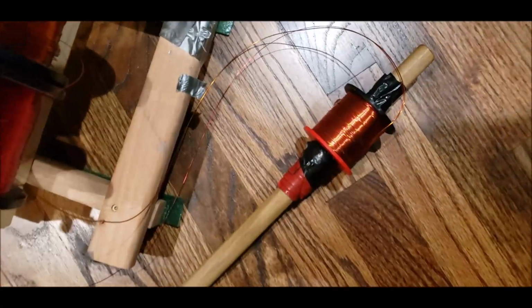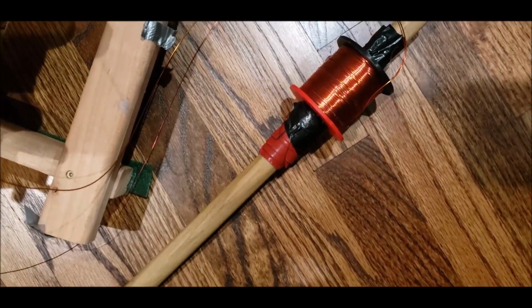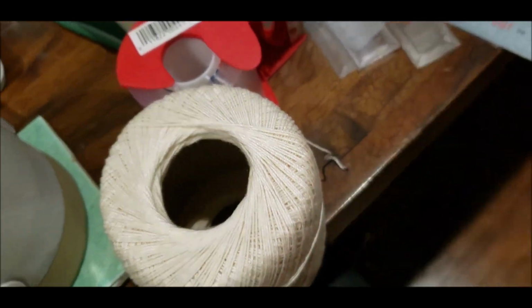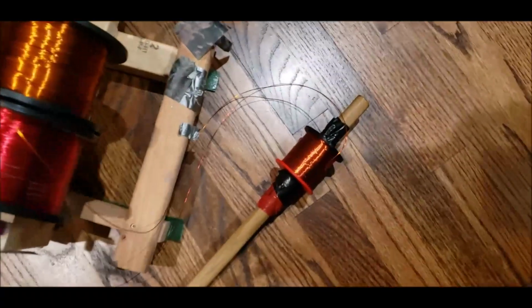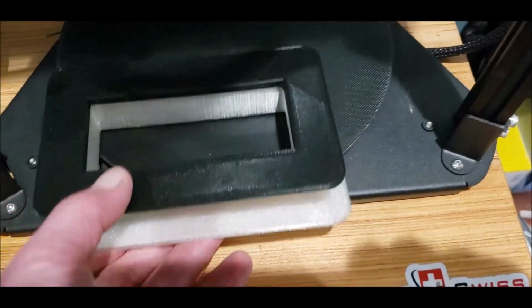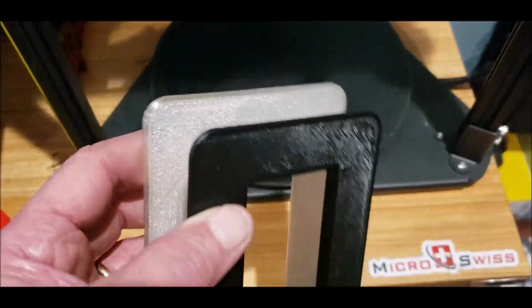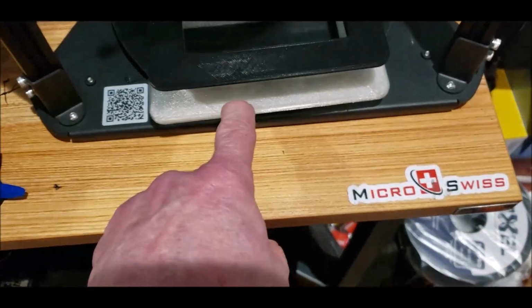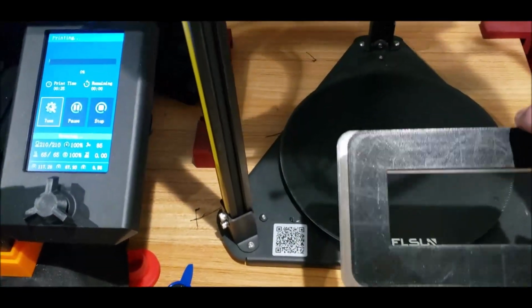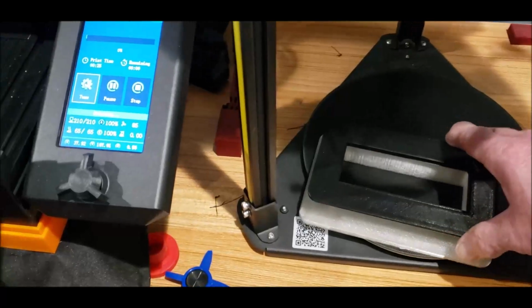All right, so the Bedini coil is coming out really nice. I'm doing it by hand, which I do now almost always, using some of this 0.5 millimeter film to go in between each of the layers. And the coil that I was printing out came out beautiful. Just one problem. I had made some changes to the body, and I didn't reflect that on the top. So the body is bigger than the top.